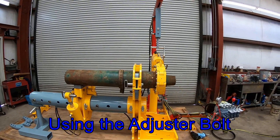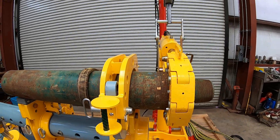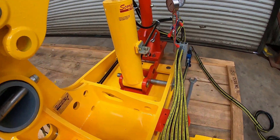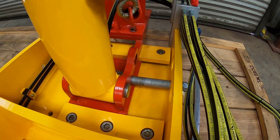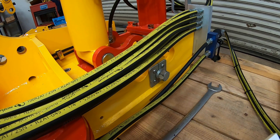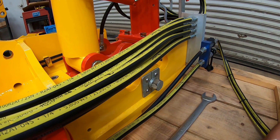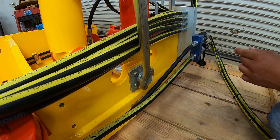The SSC model offers a wide range of grip distance or grip spacing variability. Not only can the backup arm move left and right along the large pipe, but the entire crane assembly can slide left and right along the adjuster bolt using a one-and-a-half inch socket or wrench. Note that if the crane needs to travel all the way to the left, the rails can be removed by removing the bolts and then reinstalled in order to achieve the closest grip possible.